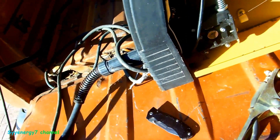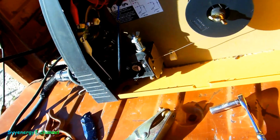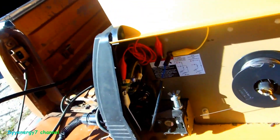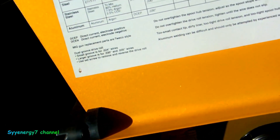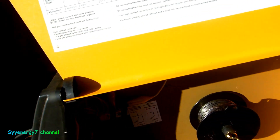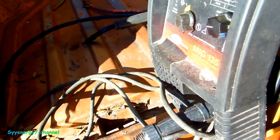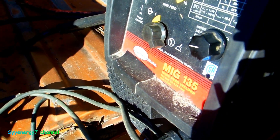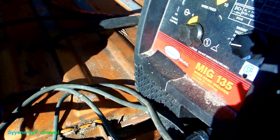This is not a 300 amp clamp, it's a 200 amp clamp, but it's a 140 amp welder. It's all copper. What I found out — and I'm gonna see if I can get my wire speed — is that I hate about this welder: you got this chart up here that tells you the speed and all this, but I can't use it because it's the rheostat I installed, so I can't say put it on setting whatever.